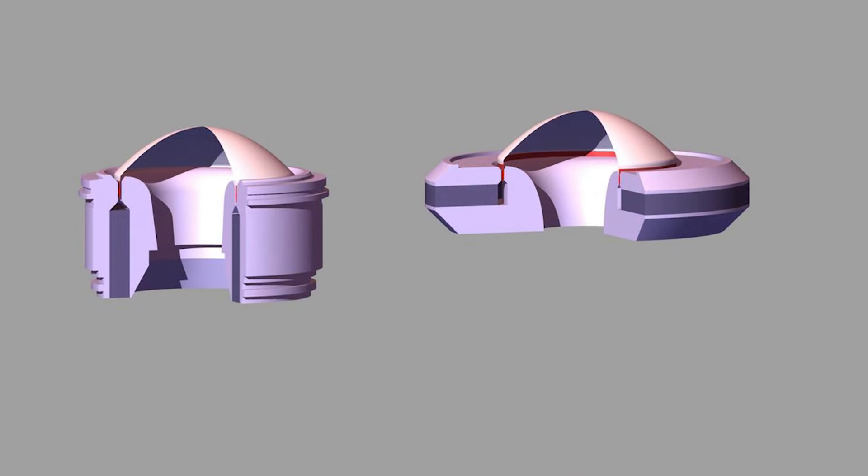With Western-tuned music the resonances will fall between the gaps between notes, and the higher you go in frequency the larger those gaps are. We like to put them outside and beyond the crossover points. Now the other drive units — I remember with the original G1 looking at the mid-range dome: there was nothing behind the diaphragm, just a hemispherical metal diaphragm with a ring magnet, and the back wave was just allowed to disappear into a tube. Did that come from the Nautilus? Yes — the use of the exponential tapered tube meant you had to have a nice big hole in the middle of the magnet, and at that point with the Nautilus we simply used an external annular magnet.